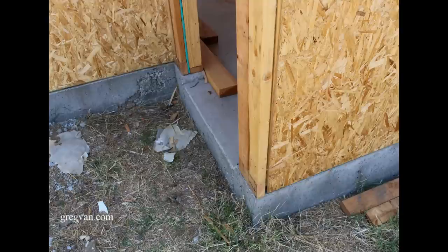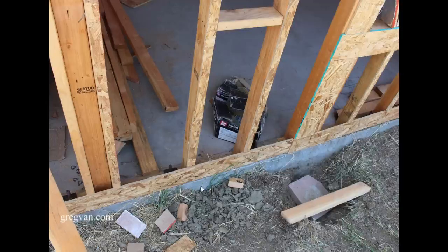Leave a comment if you need more information on that and I'll make another video. And again, here's another way to fur it out — if you're a half inch out, just grab some half-inch strips of plywood or OSB and fur the wall out instead of chipping it. Furring the wall out is going to be a lot easier than chipping something like this — trust me on that one. I've chipped out large sections and it is a nightmare.